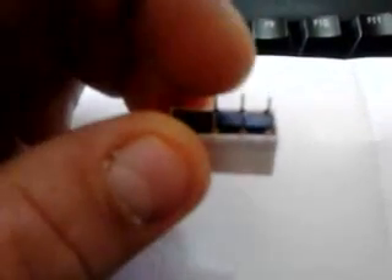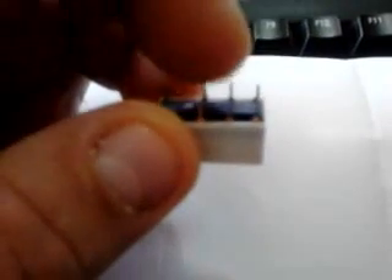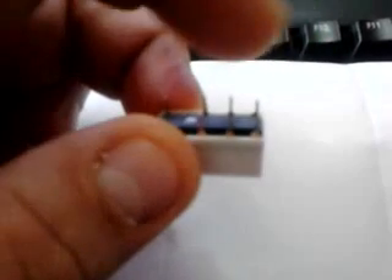I'm going to show you the pins over here and explain what this does. On these two pins, this is where you input the power. Since this is a 5 volt DC relay, as soon as you apply 5 volts to these two pins, the circuit inside will mechanically close to connect both sides — these two pins on the extremes. This is a double relay, so it will also close the circuit between these two pins on the other side.